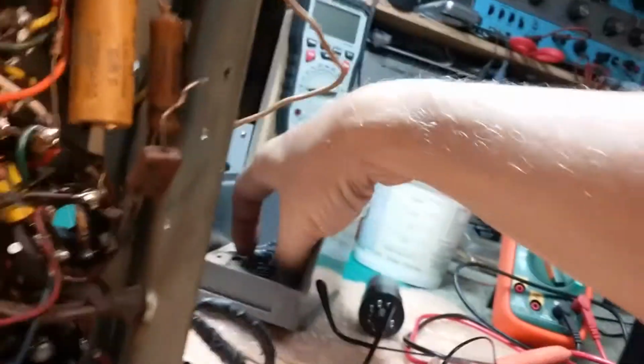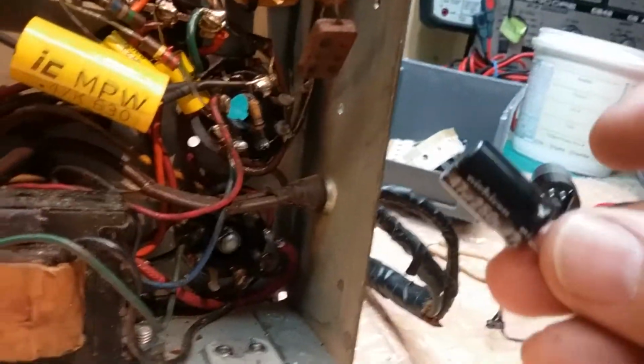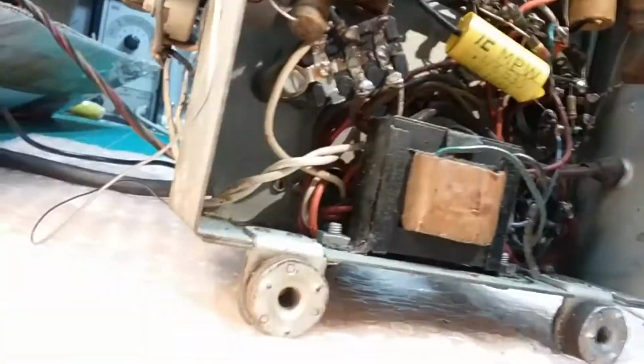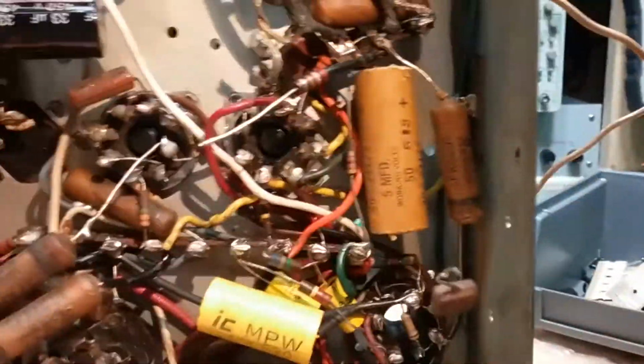I'm looking through my capacitors and expecting it to be around this size, you know, and this is 250 volts. And so for 50 volts, which is clearly marked 50 volts, working voltage 56, 5 microfarads. 4.7 is the standard today. But anyway, that's what I'm going to do. Put that in and then change this one and then switch over to these and then work back up here